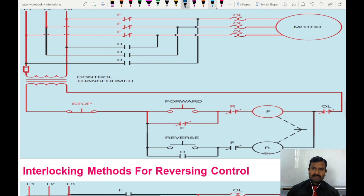This is the total wiring diagram with both the power circuit and the control circuit. When the forward switch is closed, the forward contactor energizes — shown in red lines. Latching takes place, the forward contactor contacts close, and the motor runs in the forward direction. If I press the reverse switch, you can see it is open at the auxiliary contact, so the reverse contactor does not energize. We also have a mechanical interlock as well.